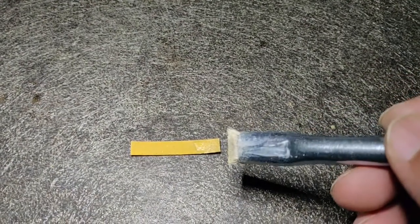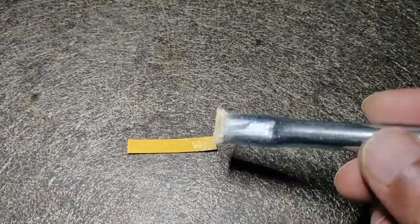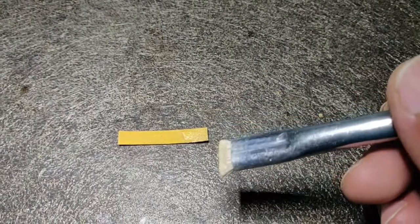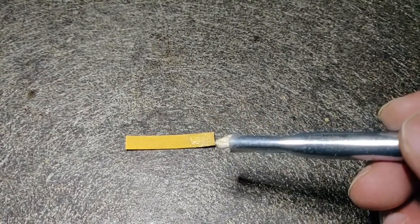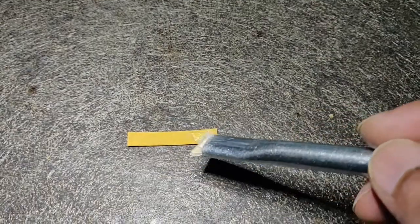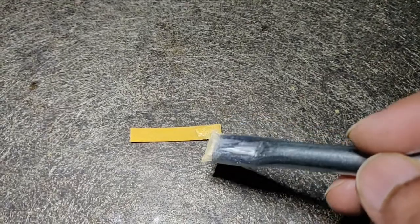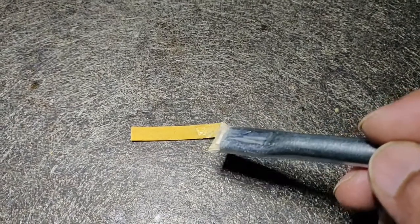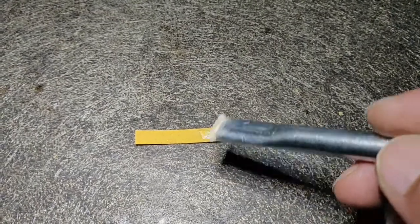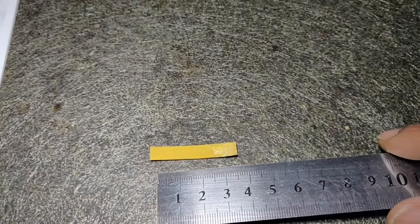Initially I thought I should clean it with acetone, but by trial and error I found dry brushing was good enough. I do it under a microscope so I can exactly see if there is any damage to the valve. I just brush enough to remove the old residue and no more, because the bristle is so stiff it can actually damage the leather.